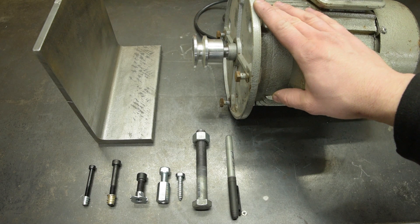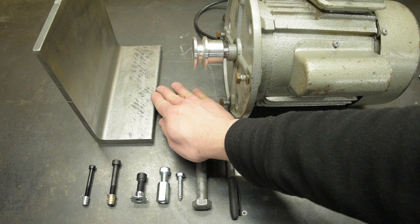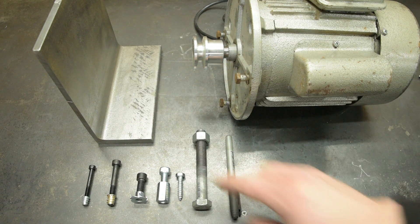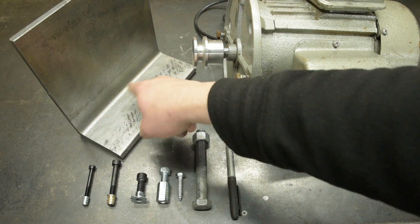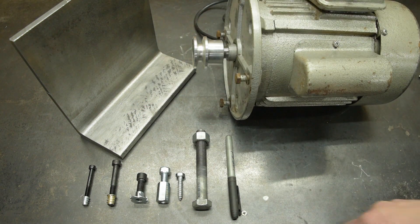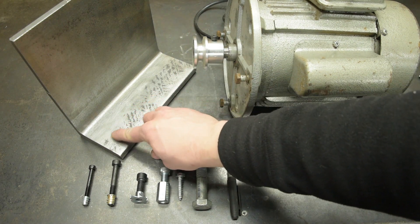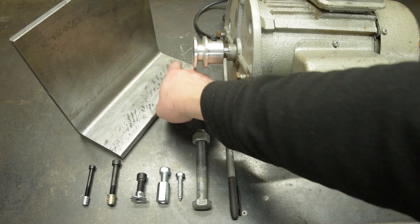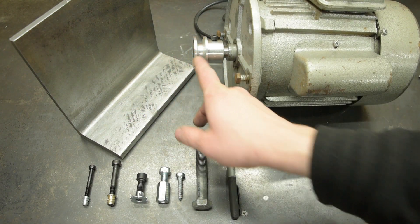I couldn't go any larger than this and in fact this outer rim will have to sit nearly down to that plate for it to work. We need some mounting holes on a bolt pattern for these screws, a clearance hole in the middle, and I think I want to put some slotted holes here so that this can move sideways to tension the belt.